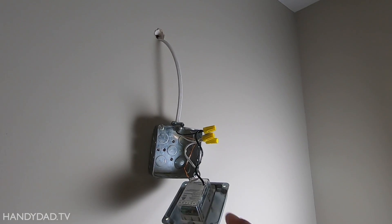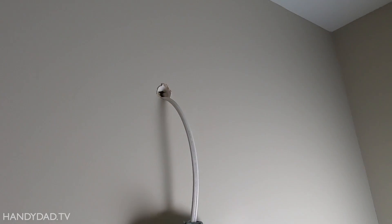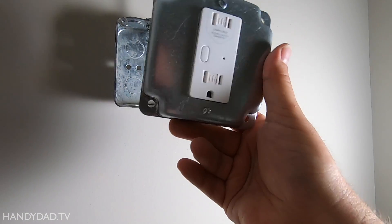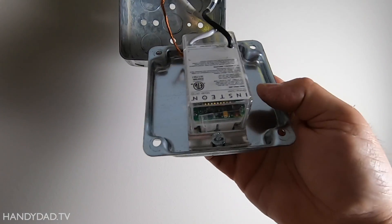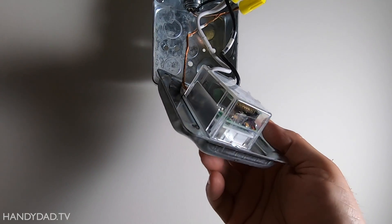Now on top of the cabinets, this is not going to be visible, so I didn't take the time to put a real outlet inside the wall — I'm just using a utility outlet here. Before I close it up, I wired that with an Insteon outlet. That way I can use Insteon Home Automation, which is what I use in my house, and that will turn on and off my cabinet lights.